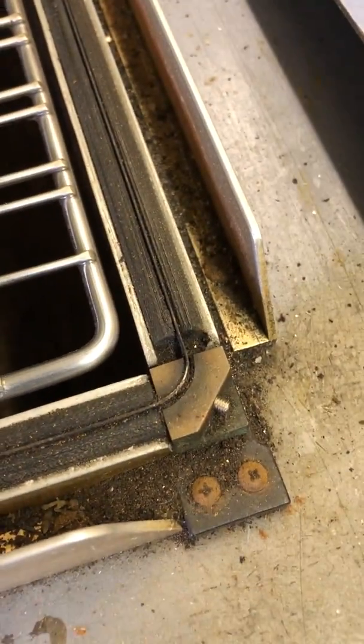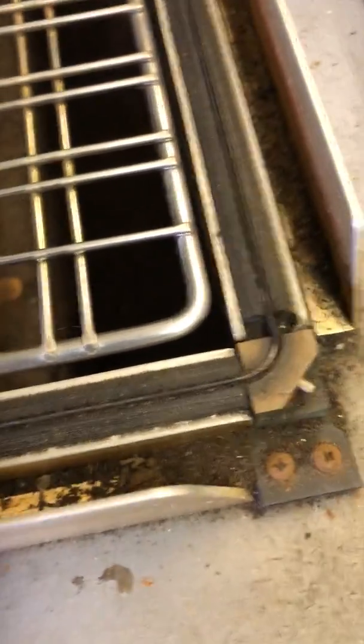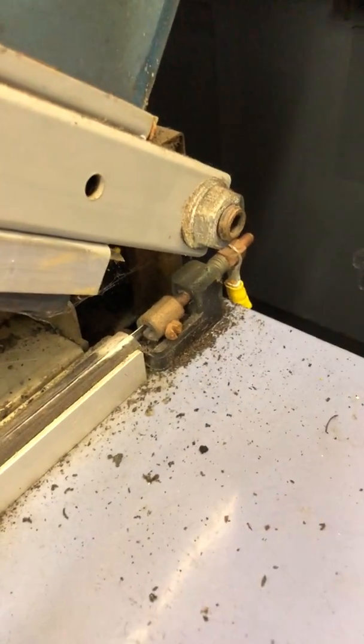The sealing system is shot. The blade's not been cleaned and lubricated. It's burnt out, it's starting to come out. Big build-up of debris down here. Corner block, obviously, that's in a bit of a poor state. We go down to the back of the machine. Again, cover's missing,